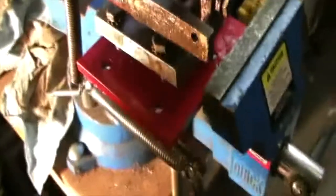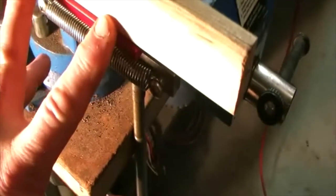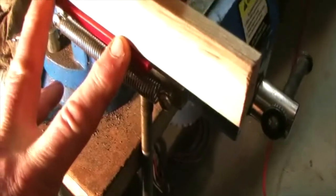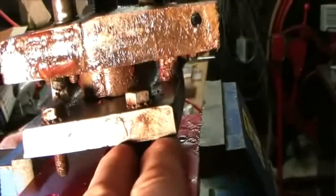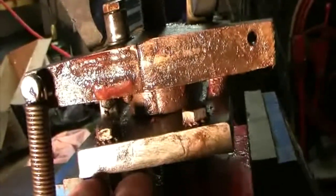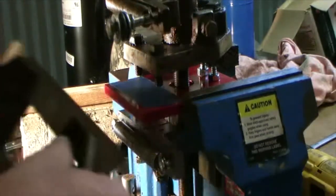So I've got this lined up, and what I did, real simply, I took a near straight edge. You can feel with your fingers just a thousandth of an inch difference practically. So got it lined up straight. There's a little bit of leeway in these holes for the bolts. I'm just going to try and mount them, get them to the center. And we're going to make a mark. Got a little square, but I put two ends on it. Sometimes I've just had the need to do that.